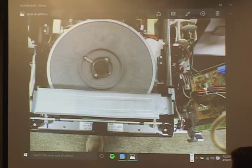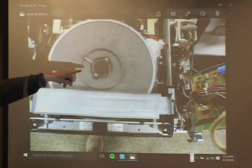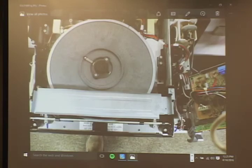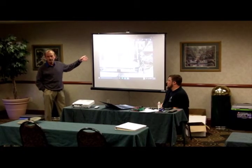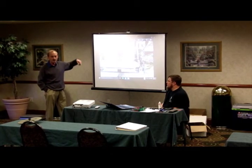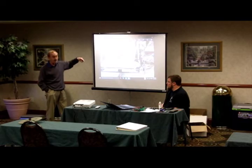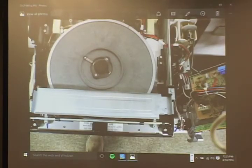This is just to show you can take the turntable out of the FG machines. Often if the picture is shaky, or if it goes from black and white to color, all it needs is a basic service, a clean and lube of the spindle shaft. Very rarely will you ever have to replace the turntable belt. The turntable belt gets the turntable up to approximately the right speed, and then the magnet and the coupling on the motor takes over from there.